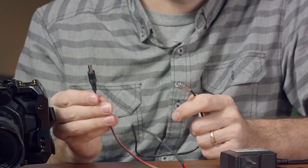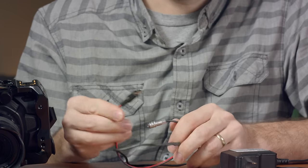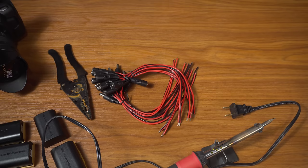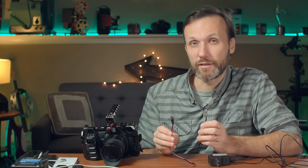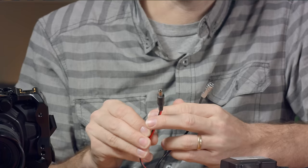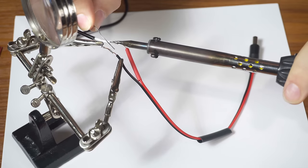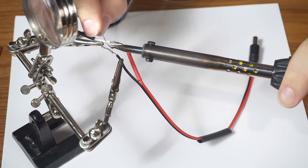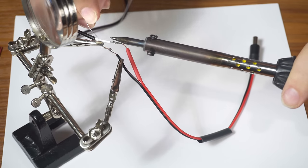The way I did it was I chopped the cable and on the other end I soldered a standard DC connection. So once you cut your AC power cable in half, take the plug that goes into the camera and attach the male end of a DC plug. You'll need to know how to solder — it's not hard to learn, there are plenty of YouTube tutorials — and you'll need a soldering tool, which is very affordable on Amazon.